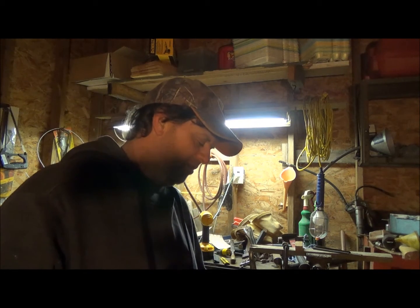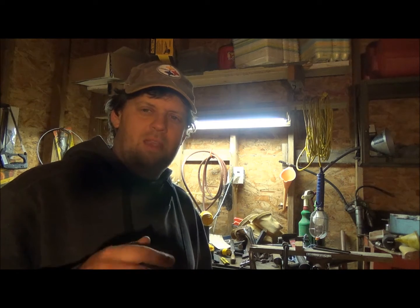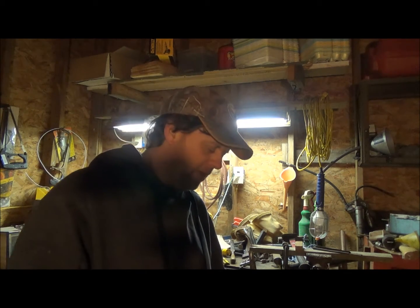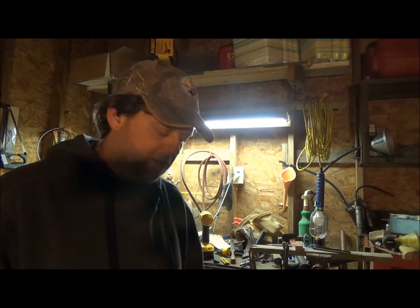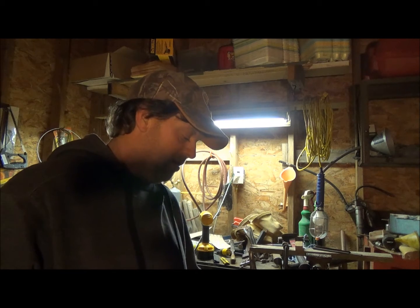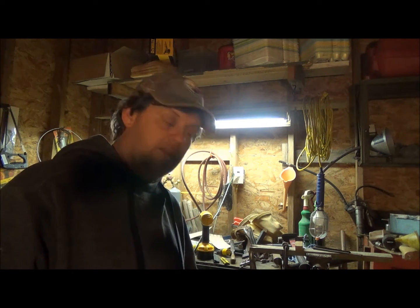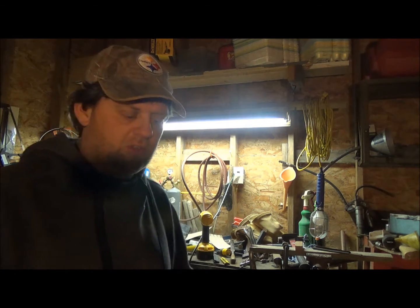And when they hit that straw color, I'll even go for just a little bit more, and if I get just a touch of light blue purple on it, I'll shut them off right there. And then I just let them cool, and then I turn around and clean them up again, and I do a second soak.